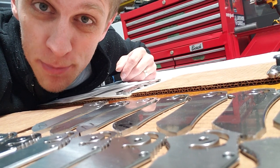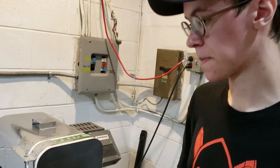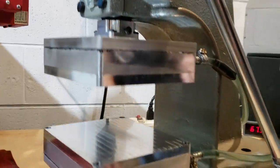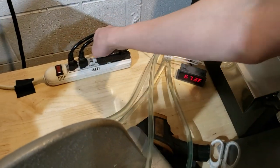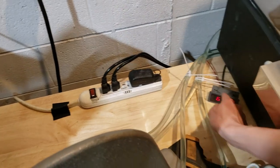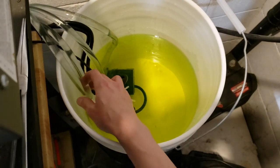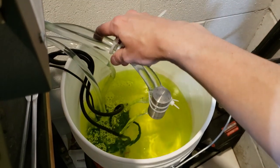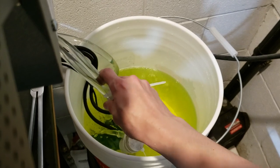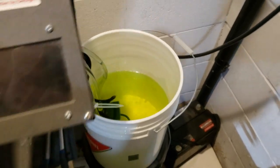We normally try to heat treat every single day, but we're a couple days behind because of those plumbing lines, so we've got some catching up to do. The rebuild is all done: the plates are all sealed up with RTV, we've got new lines — top line and bottom line — power bars moved to a more convenient position and taped down to the table. There's a temperature display for the bucket running behind the temper oven, shorter lines for quicker heat transfer. There's a hole cut in the lid for the two pumps — one for the top, one for the bottom so they stay separate — and a drain held down with a nice big piece of titanium. The coolant should keep it from corroding again.